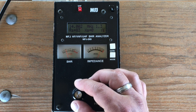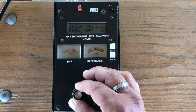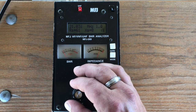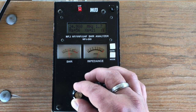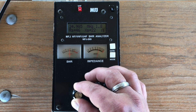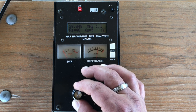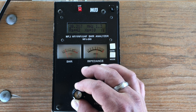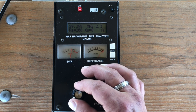Alright, so let's go to 20 meters now — 1.3 at the bottom, 83 ohms. So the ohms are a bit high, but the SWR is low. Here's 17 meters — all the little bit of it. Here's 15 meters — not bad. Here's 12 meters — really good there. And now here is 10 meters. Look at that — 50 and 1.0 right at the bottom. I doubt it'll do the whole thing. It's climbing — definitely likes the lower portion of this band.